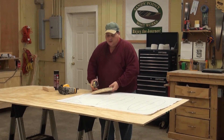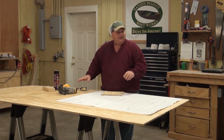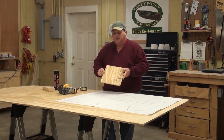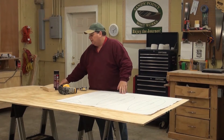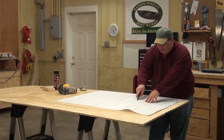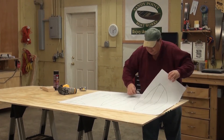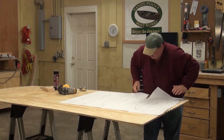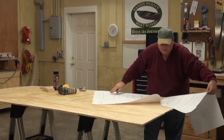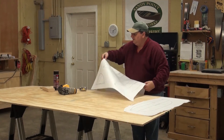One important thing: the plans say this needs to be exactly 10 inches. The reason is because the stems have the tab built right into them when you cut them, so if these aren't right the forms won't match up to your stems. So 10 inches is 10 inches — no approximation. Now, the part I left out of the first DVDs is really simple: you start by taking these paper patterns and cutting them out.